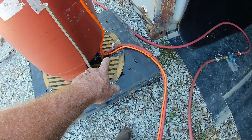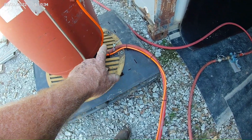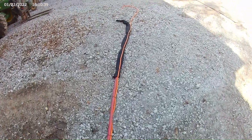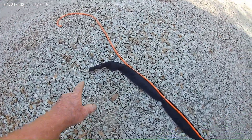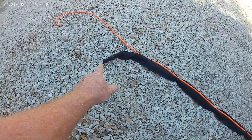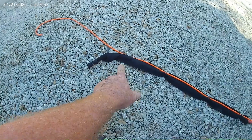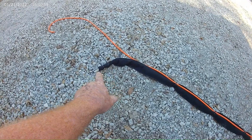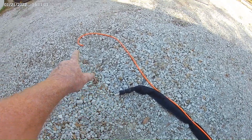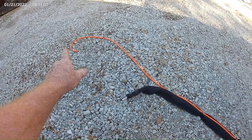I've got my discharge sand hose — sand and air mixed — it's safety tied. My clean air hose goes with it. When I get out to the end, what I did was I put on a shield, a hydraulic hose shield. So if anything was to ever happen to this hose when you're standing there — if it ruptures — it's going to go inside that shield and not come out and get you. It's also safety tied onto the end of the nozzle. That's my breathing air. I'm going to have another 3/8-inch filter before it goes into my helmet at the end of that hose.